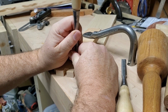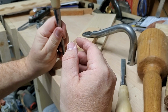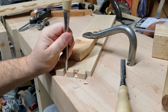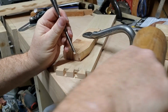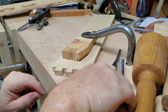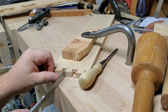It chisels really nicely. And so my recommendation, if you're going to practice, is get some wood that chisels really nicely. Mahoganies, cherry chisels very nicely. Walnut chisels really nicely. You know, it cuts without tearing. And that's, I think, easier to get started with than using a really soft wood that's going to tear and be difficult to make good-looking joints with.